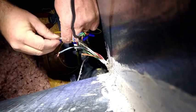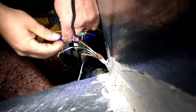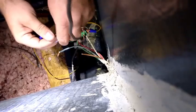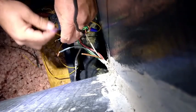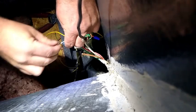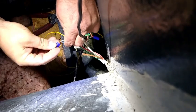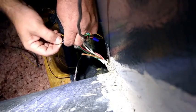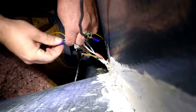Our white wires are our W2 signal for the heat strips — kind of squirrelly looking — and our blue which is our common. What we're going to do is go downstairs and make sure all these can be drawn out of the wall.